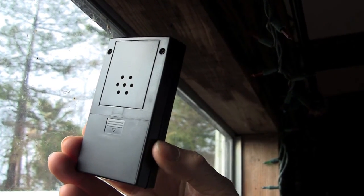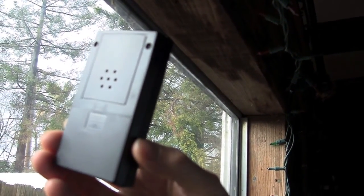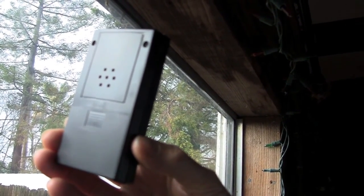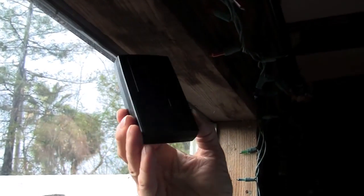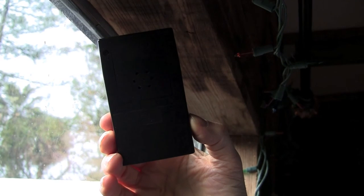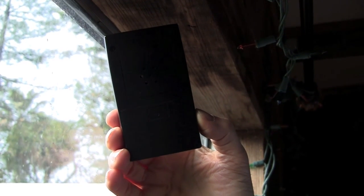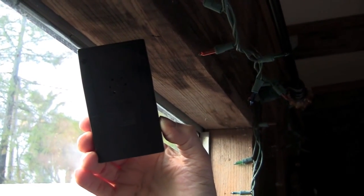There's another signal coming in there every once in a while. That is actually something I hadn't heard here in the last month, so I'm actually not sure what that sound is. That's often a radar signal — that kind of sound. I know these sounds pretty well because I've been measuring for so many years. Also I'm moving the meter around. Since the meter is directional, I'm finding the direction with the highest sound. There's like a ch-ch-ch-ch-ch — that is typically a Wi-Fi router. That didn't used to be here, but maybe a month ago a neighbor about 50 feet away from this window probably got a router. This sound function is great for helping you determine what are the sources.